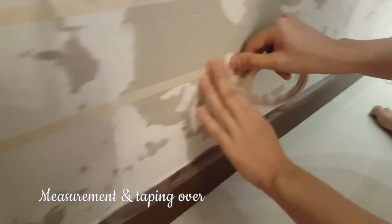After that, clean your wall and make sure most of the dust is removed as much as possible. Once you've measured and marked the measurements on the wall, tape the wall to create its grout, allowing excess tape on either side to ensure easy peeling off. You can use a leveler to help you prevent the tape pasting slantwards. But if you don't have one, make sure to mark the spots in the middle of the wall so that the tape joins neatly to the next spot.